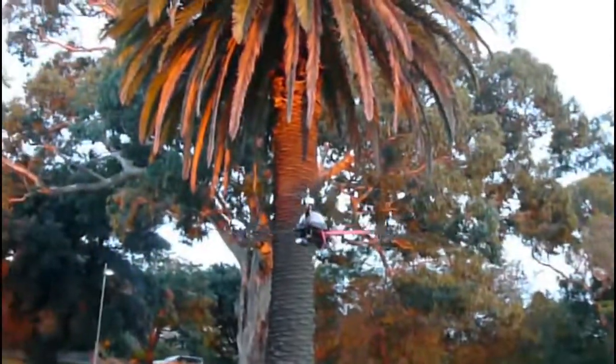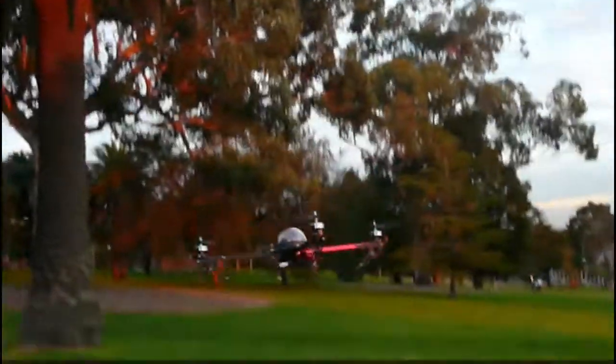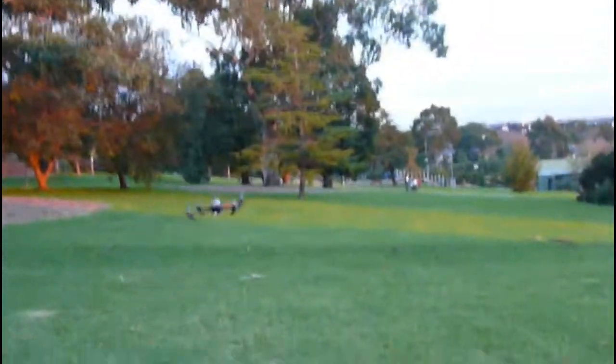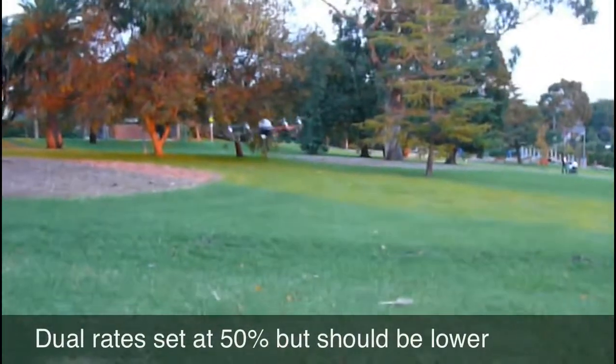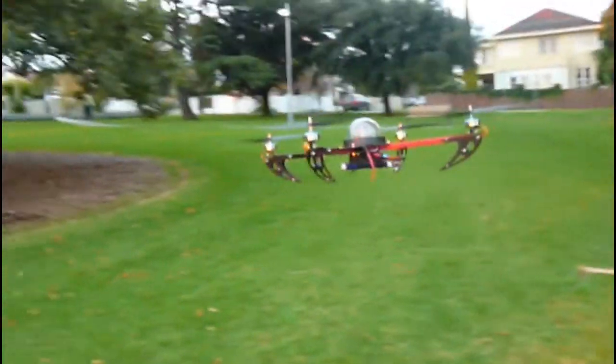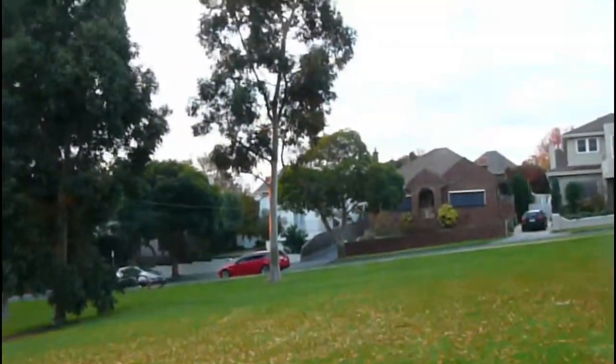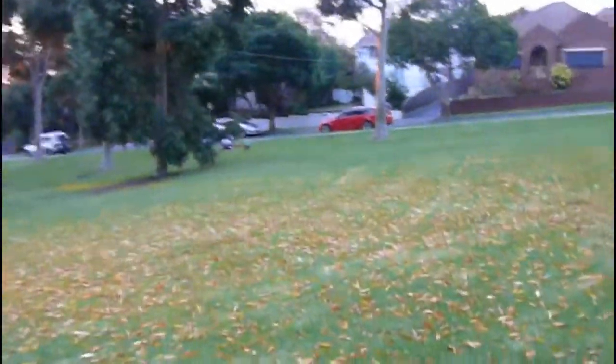It's a little bit twitchy on the throttle — there is so much throttle. I don't think I've even got maybe 40% throttle, and a couple of clicks more and this thing's going to go shooting off in the air like a skyrocket. The dual rates for elevator and roll are set at 50% and yaw is at 100%, so it's probably far too twitchy. I think I want to do some FPV with this model and I'll probably turn that down a little bit.